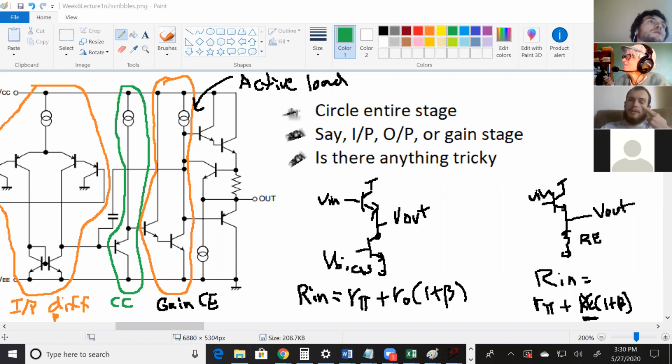I have a question. I'm just kind of confused about crossover distortion. Is crossover distortion usually part of the output stage, or are they usually considered separate things? You can consider the diode connected transistors, the diodes, as the biasing for the output stage. I guess in its purest form, it's just two transistors, which is your push-pull. But then you're setting the inputs, that's biasing.